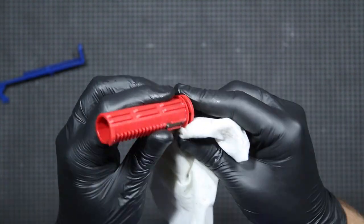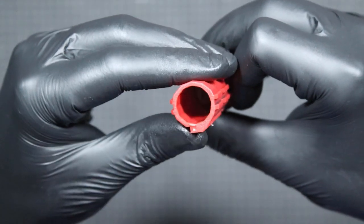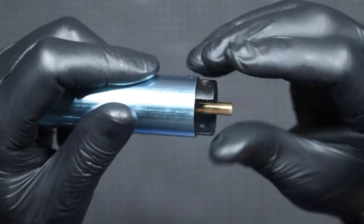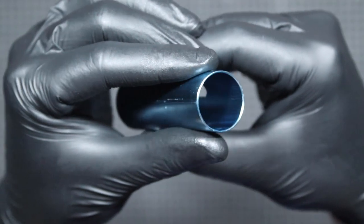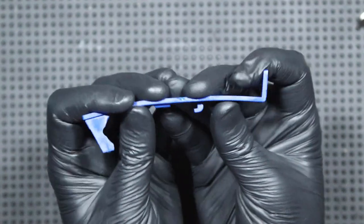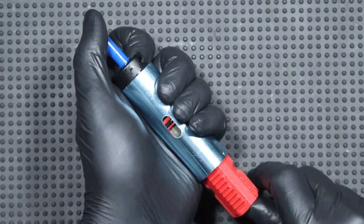It's time for the pneumatics. The polymer piston has 15 polymer teeth and only one metal one. Mounted on it is a bearingless polymer piston head with only 4 vent holes. The polymer cylinder head has one o-ring and a rather hard bumper — it sits in the cylinder with visible play, but it still holds a tight seal. The aluminium cylinder has a capacity reducing hole about in the middle of its length. The polymer nozzle has one o-ring and its length is 20.5 mm. The tappet plate is quite flexible and has a very interesting looking fin, quite different compared to a standard one. The whole system passes the syringe test on inserted nozzle as well as fully extended.